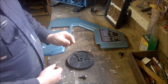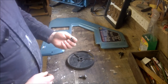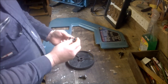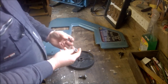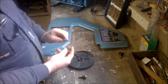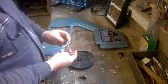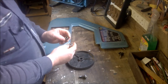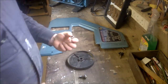I had a look on eBay to see what I could find, because eBay is the place for all things. I managed to find the closest size I could get — I'm sure it's made of best-grade 'Chineseium', so I'm not that confident, but whatever, we shall try. This one is 10mm inside diameter, 16mm outside diameter, and 15mm in depth, so it's a millimetre deeper but that's about the only difference. I'm not going to try and film the installation because there may be some swearing — I just want to help you fix your bandsaw.